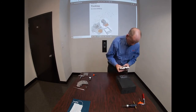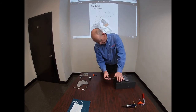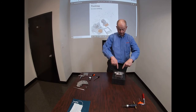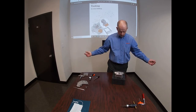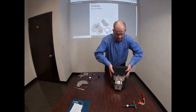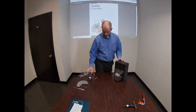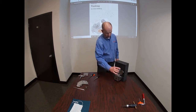We're going to mount this on. This happens to be a lever chuck, so it's a matter of locking it in place. Now we know that the leveling head is true to the chuck — just by the nature of the way the tooling is designed, repeatability is within better than two micron, which is 80 millionths. But we still don't know if this fixture is true to those references. So what we can do is take a dial indicator — this is a precision ground edge, so we can indicate across here.